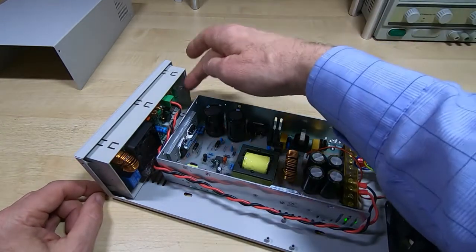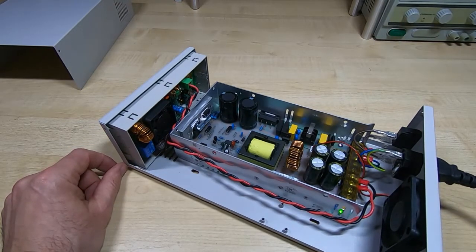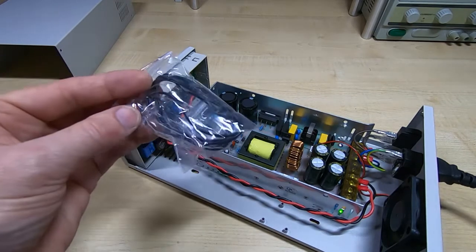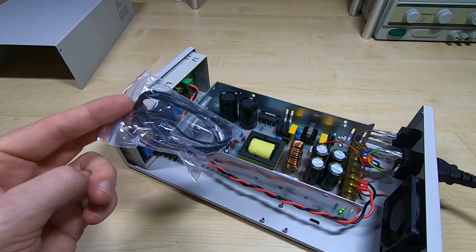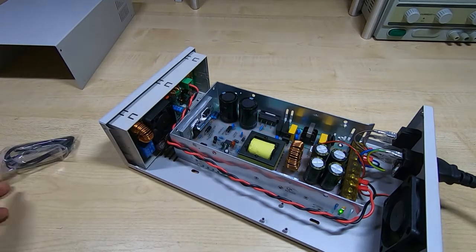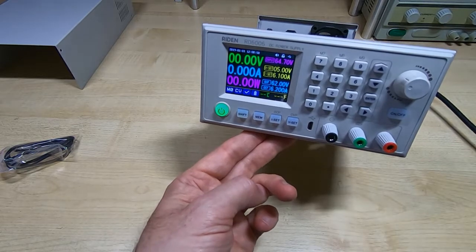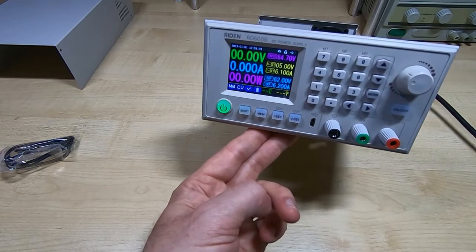But I want to fit a battery. I think it takes a CR1220. That's for the real-time clock. I need to fit the temperature sensor that came with the kit. So although I won't be using it to control the fan, I will fit this and attach it to the power supply just so that we know what the actual temperature of the supply is and make sure it's not overheating. So I'll do that. That's it as far as building the unit's concerned. What I'll do is just get this finished off, do some testing, and then once I'm happy with this, then in the next video we'll look at using it and see how well it performs.